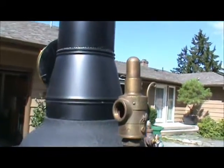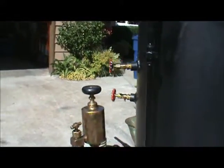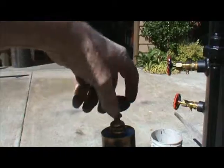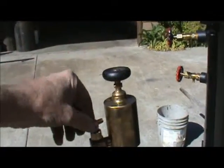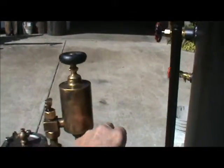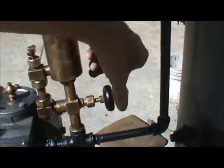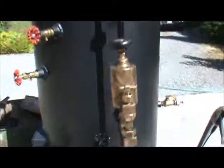The pop-off valve is set at 90 pounds; it goes off at about 95. The oiler here — you just put steam oil in the top of it. Just unscrew that, put steam oil in there. I've got the valve set pretty good, about a quarter of a turn open, and this one also about a quarter of a turn open. That gets enough steam into the hydrostatic lubricator to work.